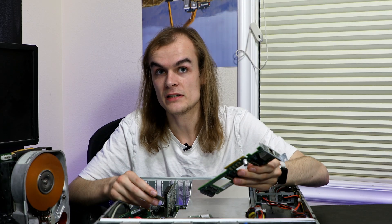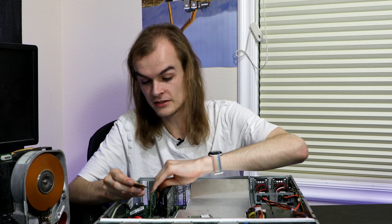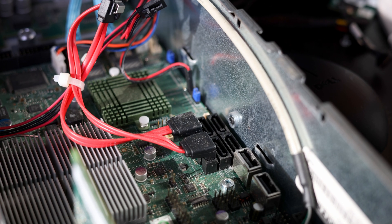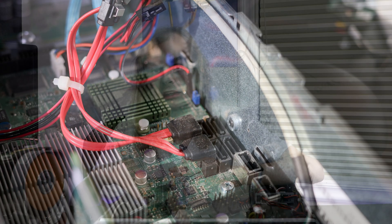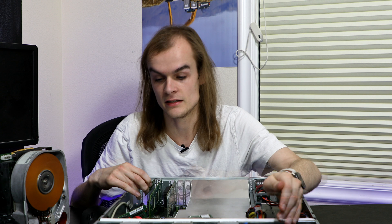Overall, it's a relatively good eBay find. I like that it's super plug-and-play — I can just slot this into a system, put the mSATA SSDs in, plug these SATA ports onto the motherboard, and have a boot drive without taking up any of my precious front drive bays for large storage or high-speed SSDs. This card would work fairly well for an OS like Proxmox or TrueNAS. They both need a relatively small boot drive with low IO requirements and support software RAID 1, so if either drive fails, you can continue with just one until the second is replaced.